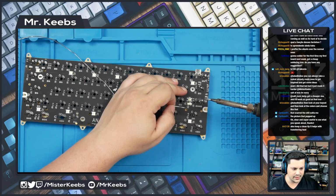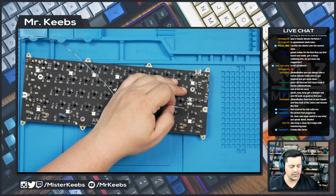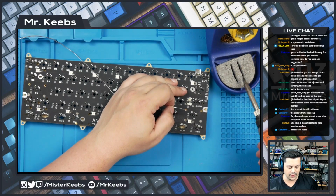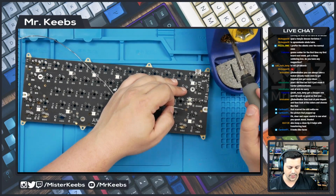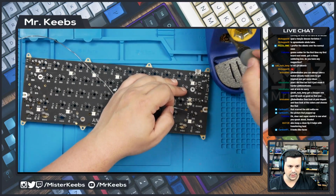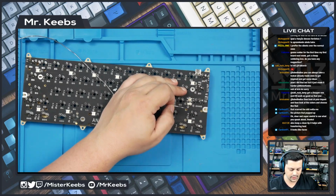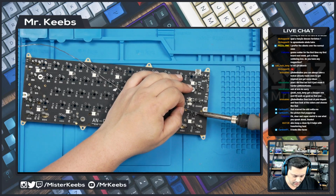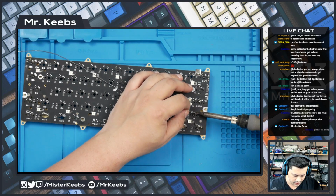Also keep a clean tip, it helps with transferring heat. Yeah. So I have this brass. Most of the people use the little sponge with water, but you can also use those shaved brass kind of thingy. And I am always cleaning it between soldering. Like I do maybe one or two switches or one or two legs and then I clean it out.